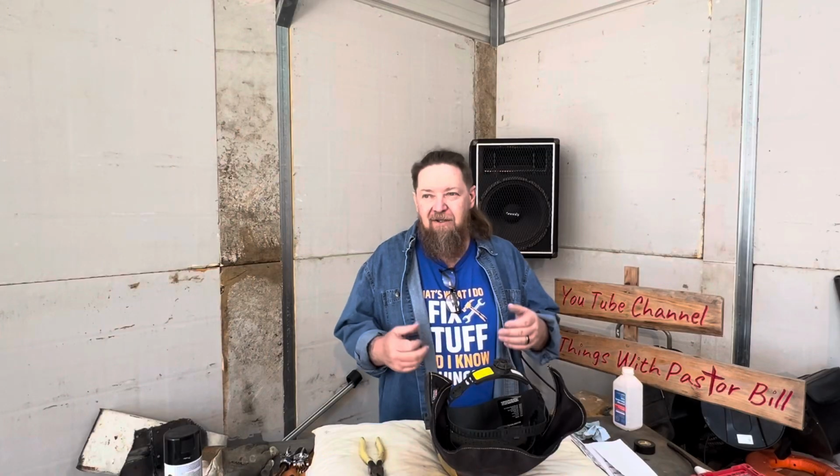But batteries have a lifespan. The lifespan depends on how many times it can get recharged, or if they just sit too long with no charge or a minimum charge, the batteries will deteriorate. It's better to have a fully charged battery sitting on a shelf than one that's a quarter charged or half charged. Now, I've run my DeWalt batteries down, but they've got safety mechanisms inside so it doesn't get past a certain point. Same thing with the lithium ion car batteries. They have a cutoff point so the battery doesn't get below the safety level, which causes deterioration. It's going to deteriorate over time anyways. But the thing is to have your batteries last as long as they can. That is the secret.